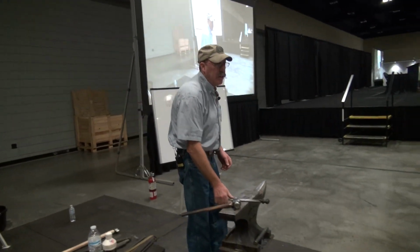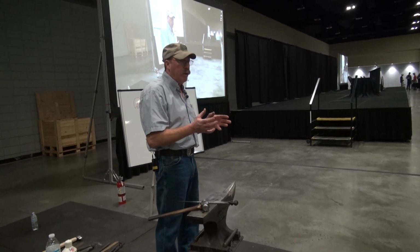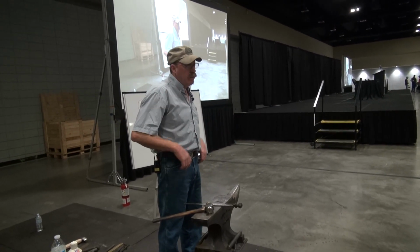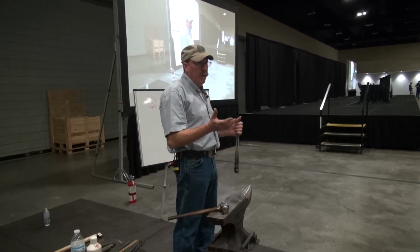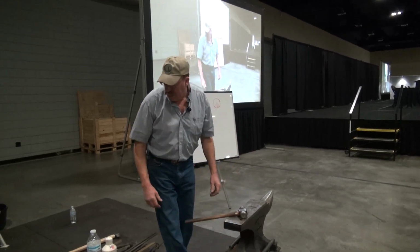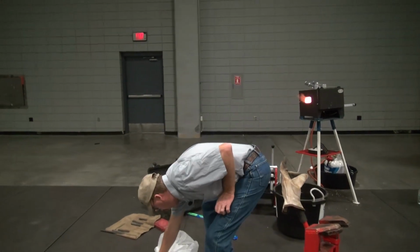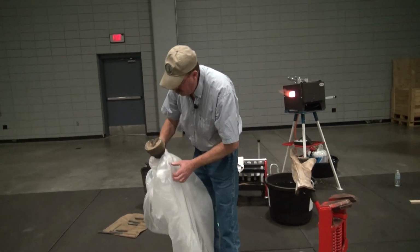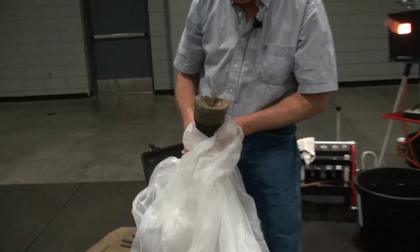So we'll come out and take a little toe off and go back in, take the toe bend. The toe bend of the shoe is really important. You don't rush through this part. So get your toe bend. And as soon as we make our toe bend, we'll probably be able to tell which side is to be the outside, which is to be the inside. Meet your lateral for everybody's sake. Well, this one don't have much medial lateral. It just kind of comes off on the back.